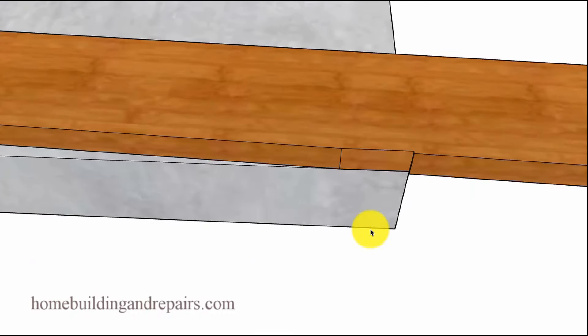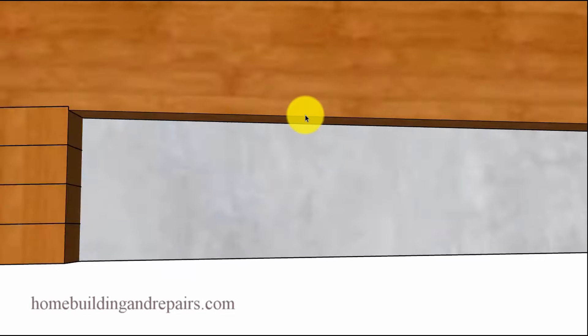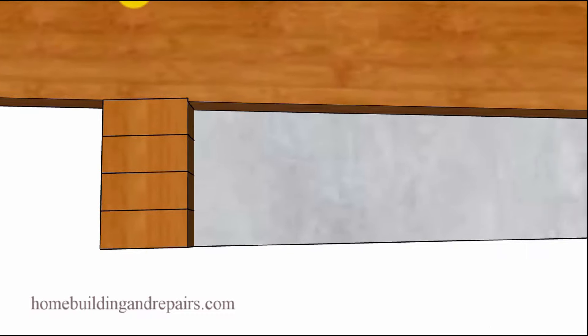We're going to use this line here to represent the difference in the height of the wall framing plates to lay out the roof rafter. You need to line up the edge of your roof framing lumber — before the seat cut is cut — at this point here with the building foundation edge, and not this other point here. It's more common for everyone to line up the lumber with the corner of the building foundation, and in reality it won't make a big deal if you do make that mistake.